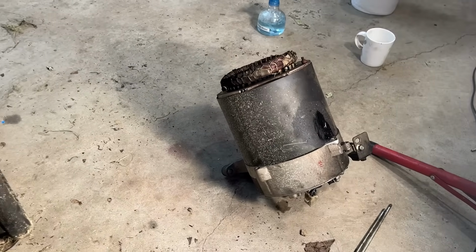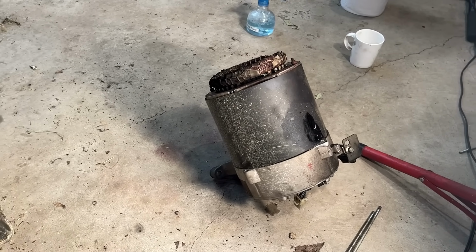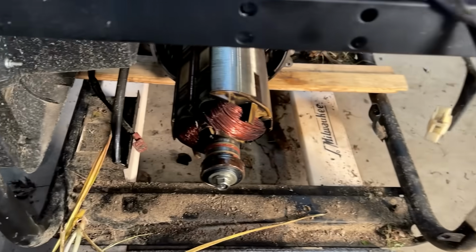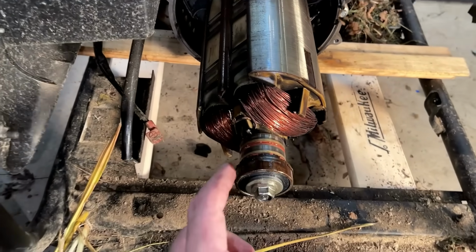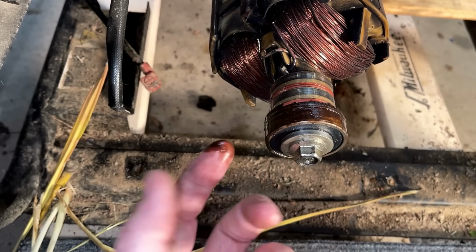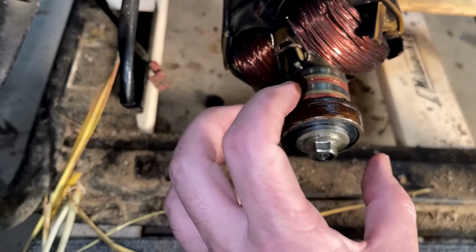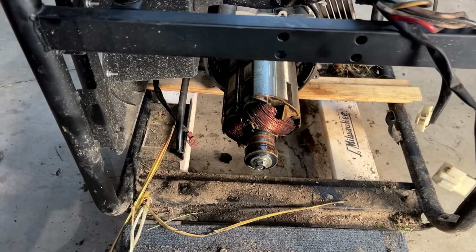And that is supposed to be the easy one. Usually stators come off without much of a fight. It's the rotor that you have to worry about. In this case, because this machine was left outside, there was a lot of rust that formed on the outer race of the ball bearing, and just some rust jacking was holding things in place. So I'm not sure how I didn't break that end housing, but somehow it released.